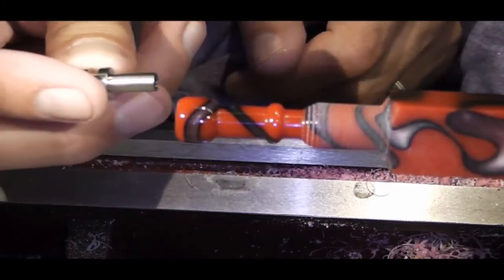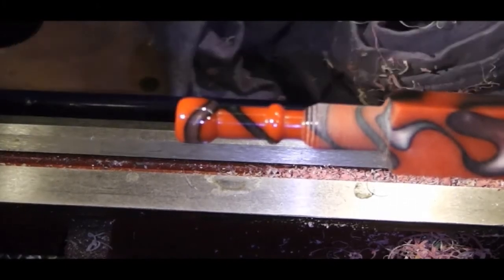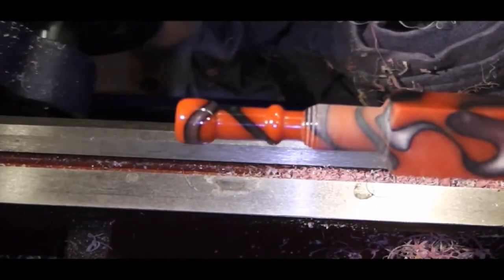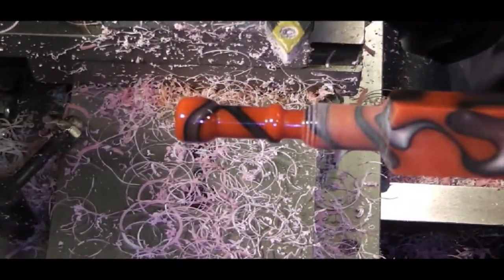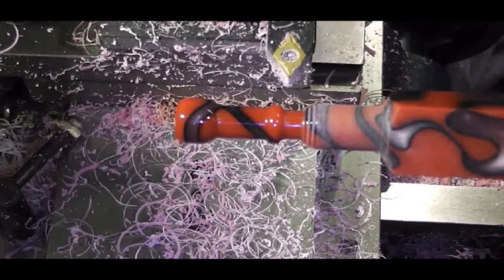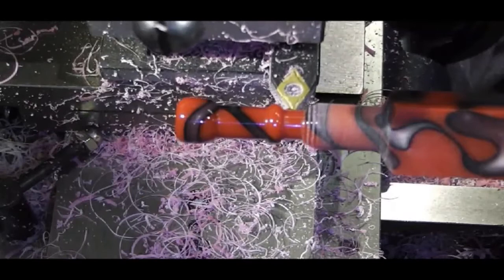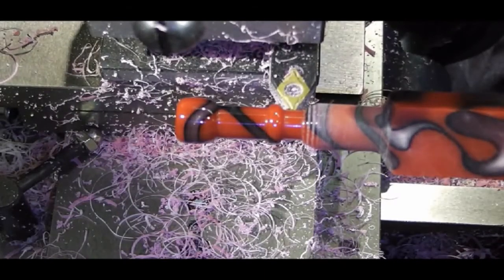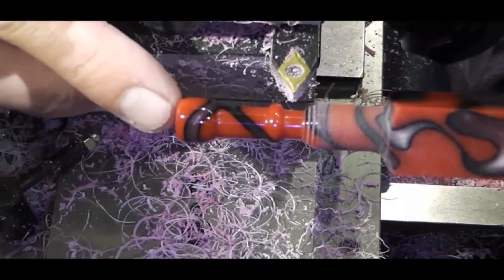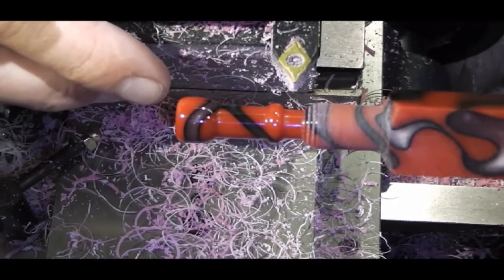But effectively, all it means for cutting off for me on the metal lathe is going to be to bring in the same tool that I've been working with, and bring that in at this end and just work this through. This will come off in my hand, and then I need to drill from the other end. And I use the same technique as Graham has, which is once this is fixed in, I'll pop that into the other end and drill through the other way.